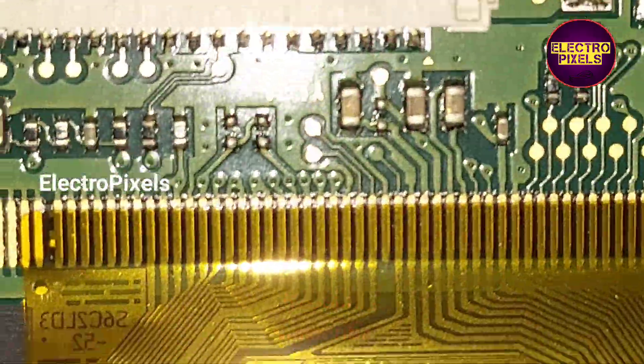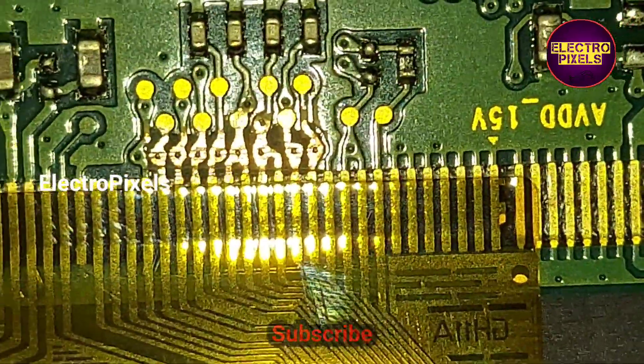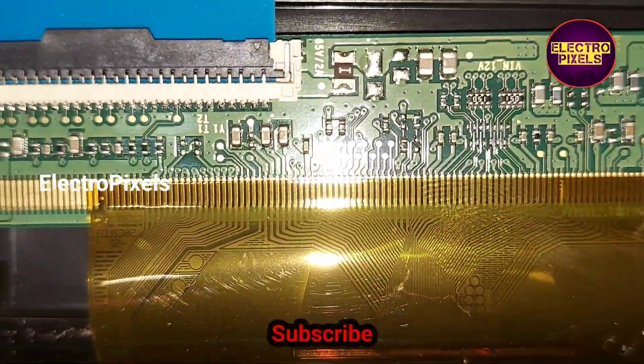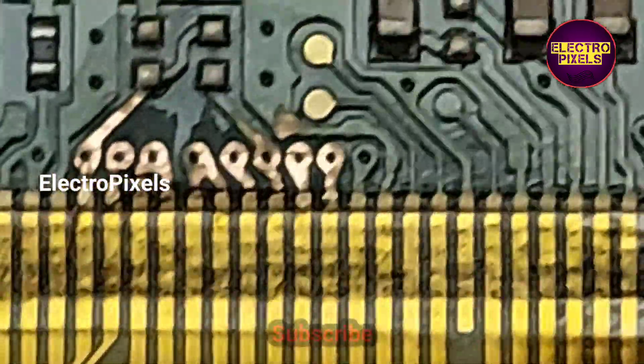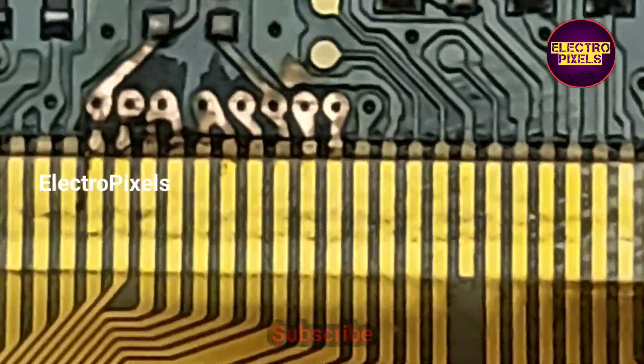In this situation, we need to rejoin all the cut tracks on the right side. The right side gate signal tracks that were cut earlier are now rejoined. Now we cut down the left side gate signal tracks — the left side gate signal tracks are now cut down.